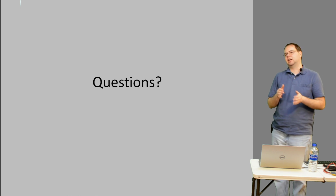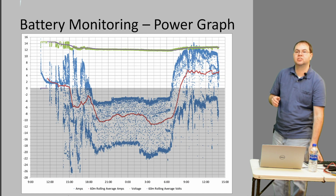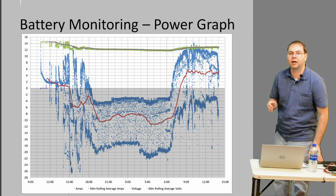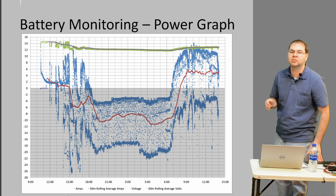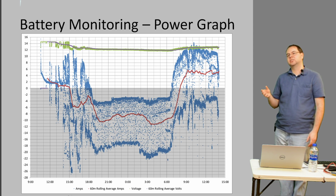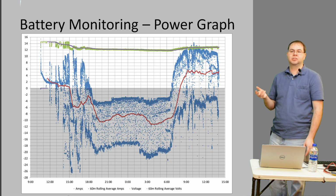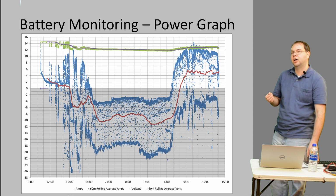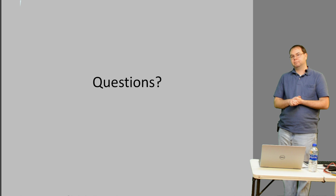So I was pulling a little bit more than that peak, having 3 of them, and my peak pull, we can probably see that. It looks like I was pulling around 26 amps at the absolute worst case. Most of the time it was closer to 25 amps. So I was a little more than what the 20-hour discharge rate to completely drain them would have been. But they were the cheapest batteries that I could readily source, which was good because I wasn't planning to purchase them at that point. But yeah, they're supposed to be dual use starting and deep cycle storage, the Walmart RV and Marine batteries.